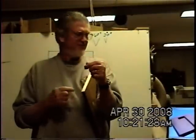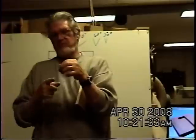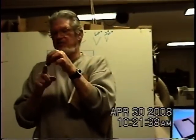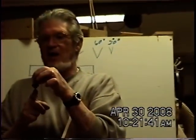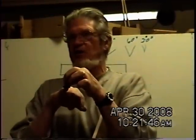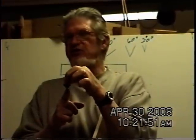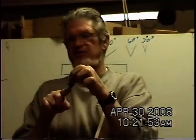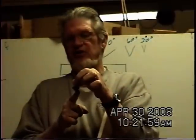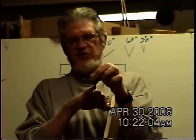If I was going to do a normal setup and went out and bought a $40 round over bit, it would start off from the very center line — this part here would start from the center. But I made up a thing for the machine using a new bit. You don't want to start this on the center line, because I would be cutting flat spots, plus I'd have a hole stuck in the middle.